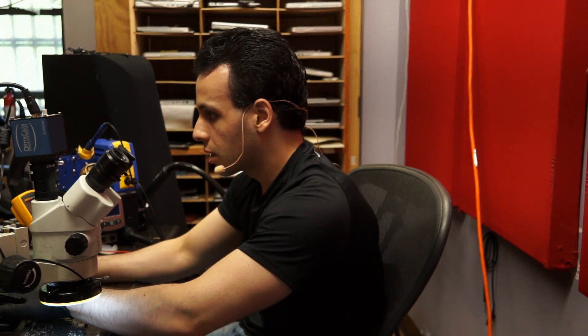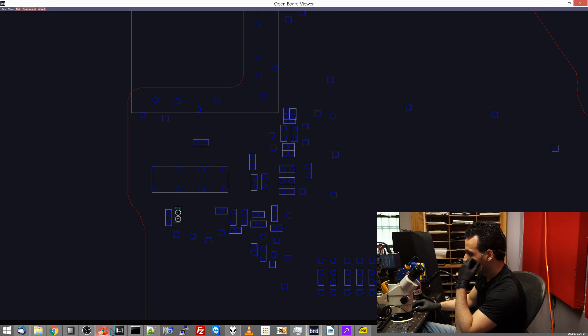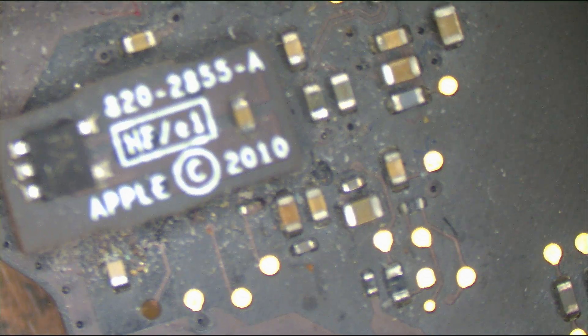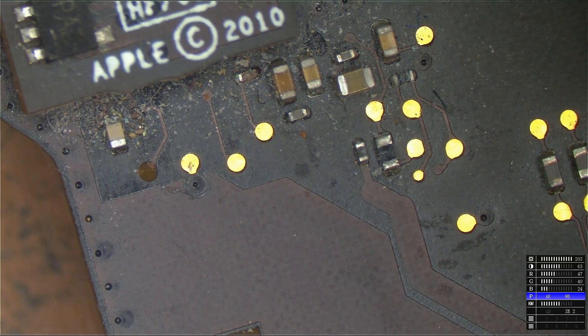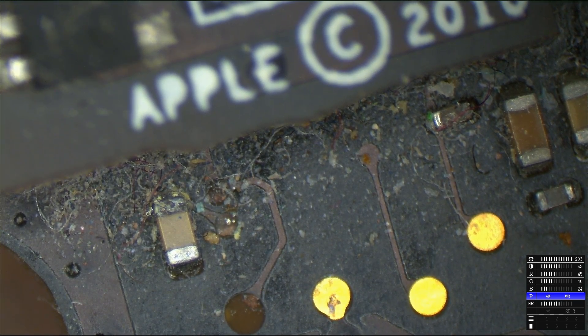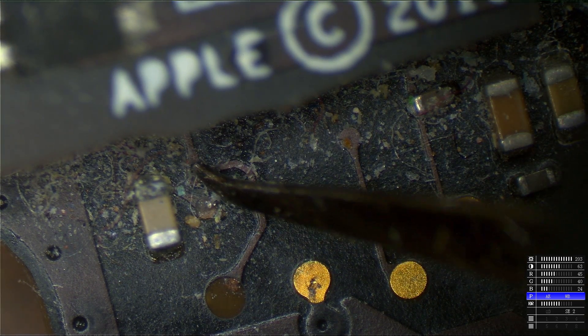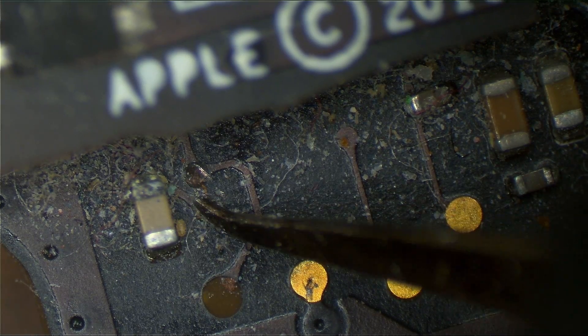Looking at the new BoardView software for component R5250, you can see it right over here. Now going over to the microscope — note: I messed up my OBS scene so I'm overdubbing this after the fact and didn't notice I wasn't recording audio. The first thing you'll notice in the area where SMC_lid is, near what I assume is the sleep sensor, is that there appears to be a resistor missing next to that capacitor. When you zoom in, you can really see where the damage was — right where this trace is going to a probe pad that's destroyed. I think of that as where the lightning struck when it comes to liquid damage.